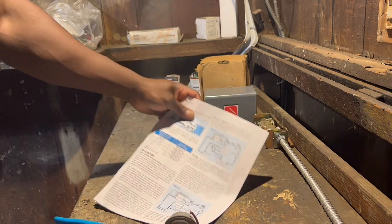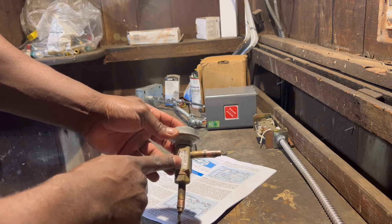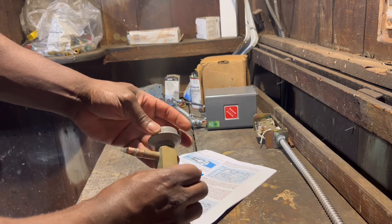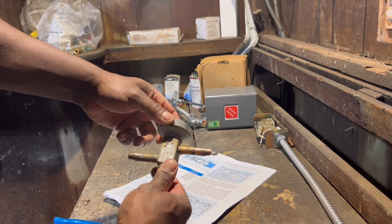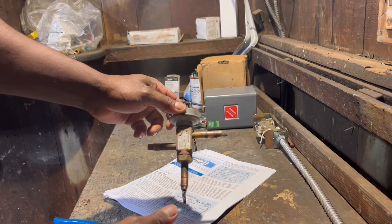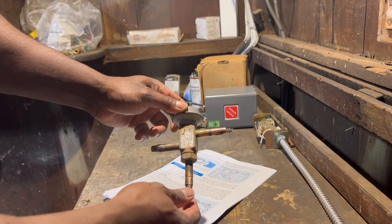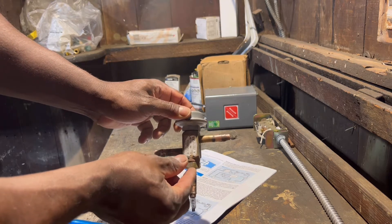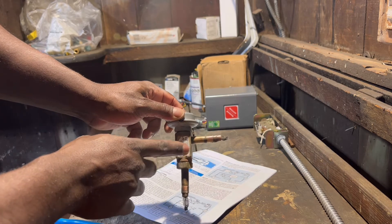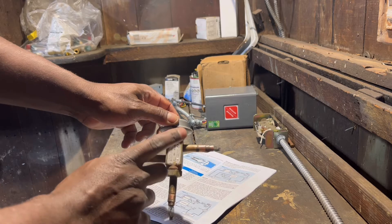This one was just bad — these tend to stay open or stay closed, that's pretty much what they do. But it's pretty cool because you don't need any electrical to operate this; it's just pressure. Pressure drops, it just modulates, opens up a little bit — just enough to maintain that 180 PSI on your high side.